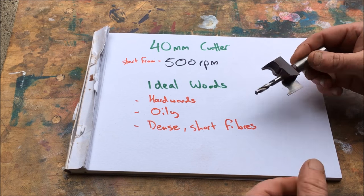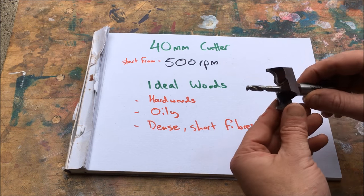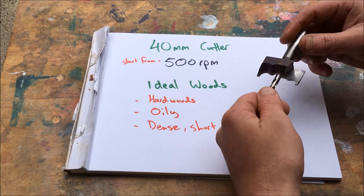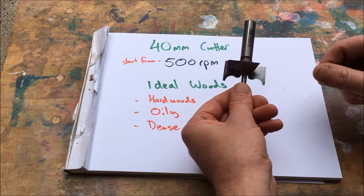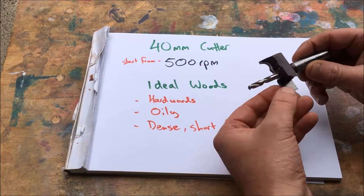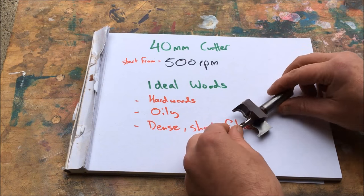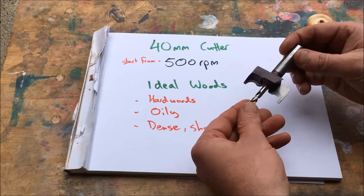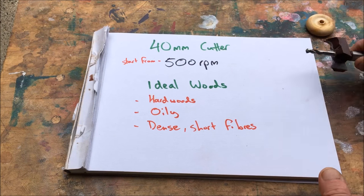With the 40 millimeter cutter you want to start at a speed of about 500 RPM, then test and see if you need to go faster or slower. Because it's symmetric and has the same weight on either side, it's fairly safe to run at a faster speed — unlike some of those offset circle cutters which are an accident waiting to happen. The only concern with running faster is the bit heating up too much. I get a good result with pine at about 1000 RPM, but give it a rest — don't try to do 50 at once. Do about five, stop, do another procedure, then come back.